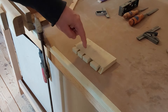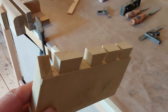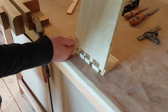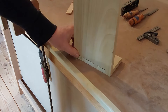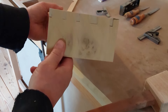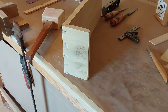This is the demonstration piece that would be the side of the box. I want to show the way the pin sockets look when they're pared. This is the top of the box; this is the top of the front of the box. It's a very tight fit right now — I'm going to have to work on this. You can see it's not quite seated yet; it's starting to fit. I'm going to take it out, pare it more, and then come back.